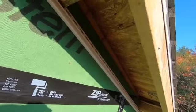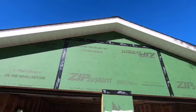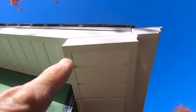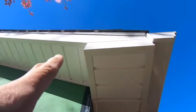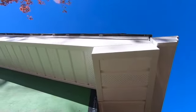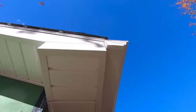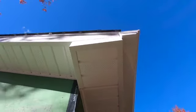Here's one finished gable — got all the soffits run down, the fascia is on. I'll show you how I bend these outside boxes. One thing I could do — it's a matter of preference — is trim those little pieces and make it a 45-degree miter. I sort of like the straight look, but if you wanted to miter that would be really easy to do. So let me take you inside and show you how I bend a couple of these boxes.